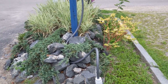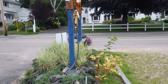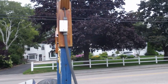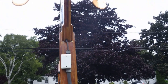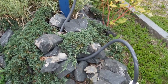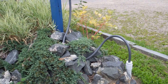So we have a couple of violations. One of them is definitely the lack of supports. Section 356.30(1) requires this liquidtight flexible non-metallic conduit to be secured within 12 inches of that box and then also every three feet. But as you can see, there are no supports here other than the rocks that are holding it up, and it's just flopping through the air and stubbing into this plumbing PVC.